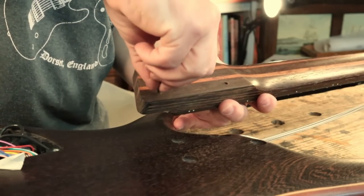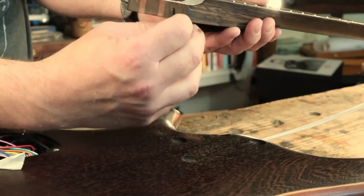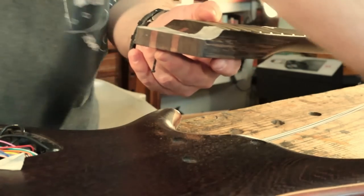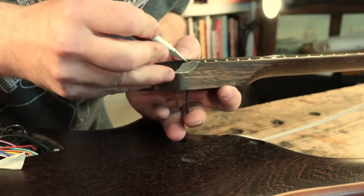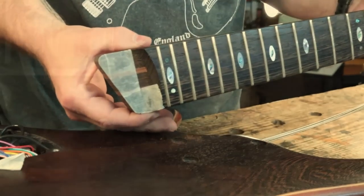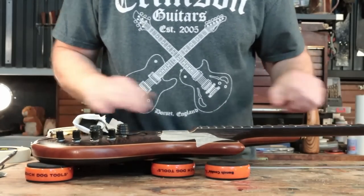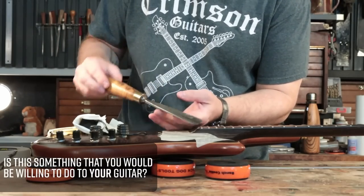There you go, very precise depth stop. I've got about 4 millimeters that I can cut into. I'm also, while I'm here, just going to draw on where the holes are. All good. Now, back together, because I need to carve the whole thing in one piece, don't I? All right then, so I'm going to be using a gouge